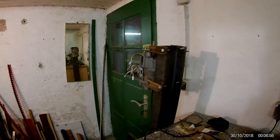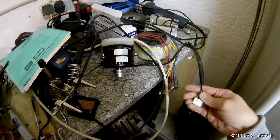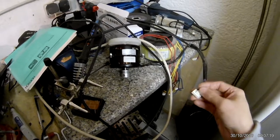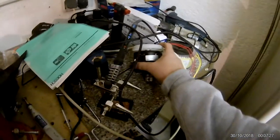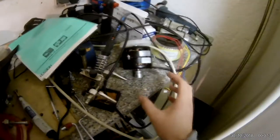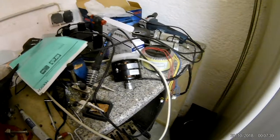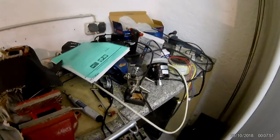According to the wiring, this motor has two coils — just like the washing machine motor — so maybe I can use a run capacitor. It says 10 microfarads, 200 volts AC, so I guess that's the run cap to be connected across one of the coils. I don't know if I'll ever get around to this one. It has a nice integrated fan that blows air forward over the motor, which is useful — maybe for something small like a mini automatic hacksaw or mini belt sander.